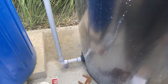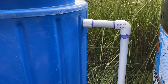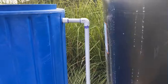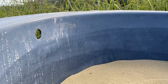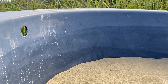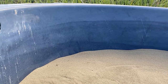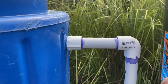I connected the outlet of the sand filter to this blue tank. The height of this pipe will be approximately the same height as the water level in the sand filter. I never want the water to drain out of the sand filter because I don't want to lose the bio-action of the sand — so the sand can't go dry. That's why this pipe is approximately at the level of the water.